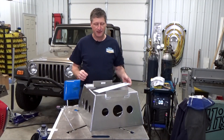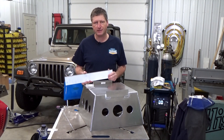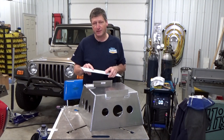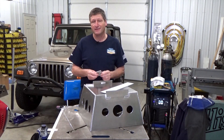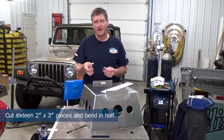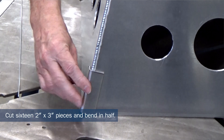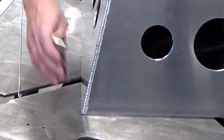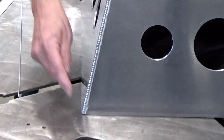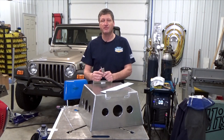Last but not least, you'll have a few drop-off pieces left from your 4x8 sheet — these are about three inches wide. Cut 16 two-inch pieces off of them and then bend them at a 90 degree angle. These are going to be your bottom corner doublers. After you weld them on, check your corner welds and make sure they're flush with the sides — grind or file them if needed.